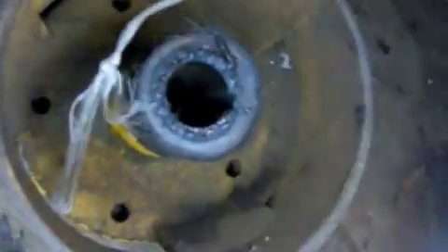Nice and clean, still has the PTO plate on and everything, and these axles were still good. The only problem was a little ding in the keyway, which isn't really too big of a deal. I already pulled the other hub off earlier and it's still really good on that side also, so it's a good transmission. This one is a little older than the other one - on the red one you saw the brass ring gear with cutouts, but this one has a solid brass ring gear without the cutouts on the side. It's also got a good brake drum; the keyway's a little worn but it's really not too bad inside.